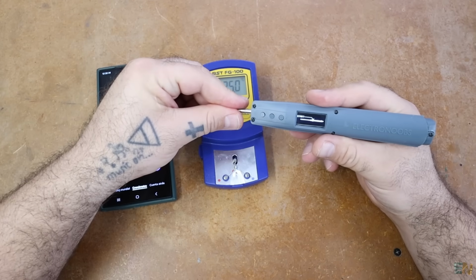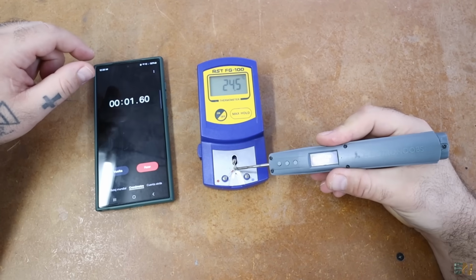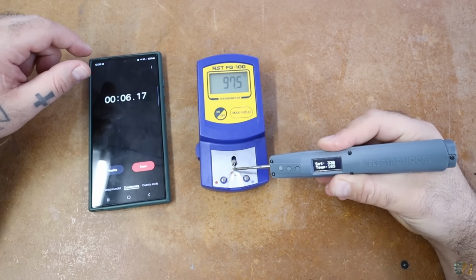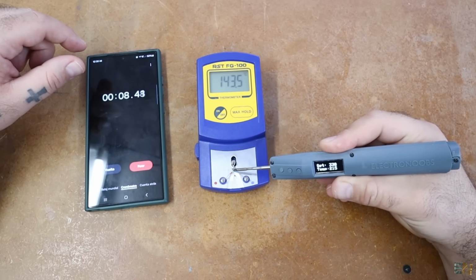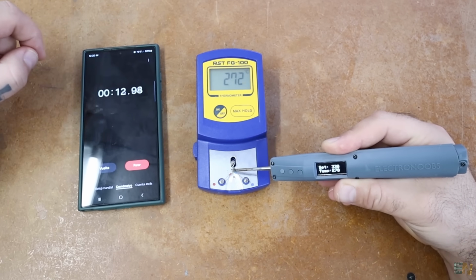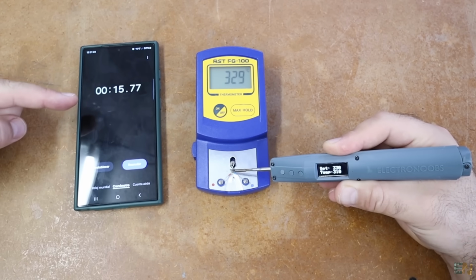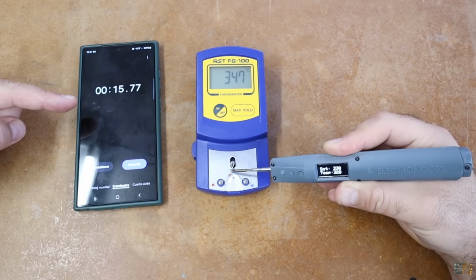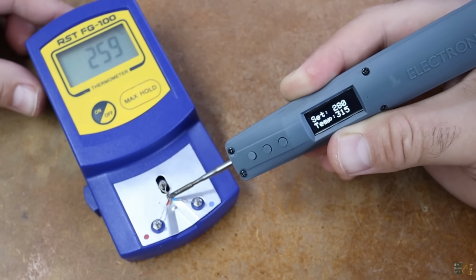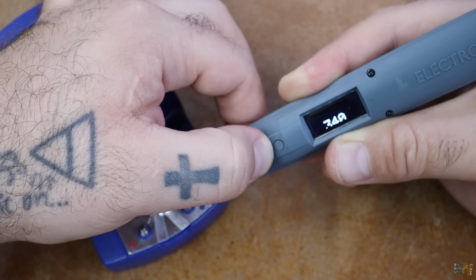Here we have a speed test, and it reaches 300 degrees in around 15 seconds, which is not bad, and we could make it faster by making the PID code more aggressive, but with that it might overshoot. It's also quite precise because I set it to different temperatures and it keeps the values at that set point with no problems, so the PID works.